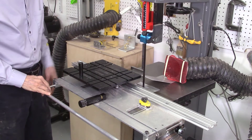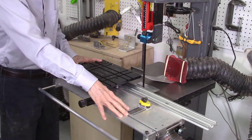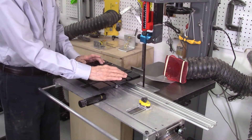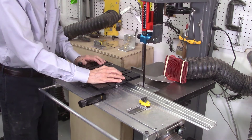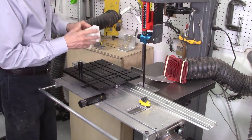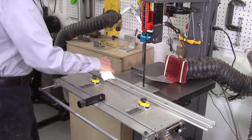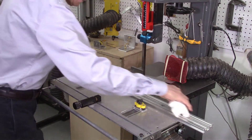Now we're ready to get started, but before we begin, we have to get the AccuSlice system and sled set up. I've installed my AccuSlice index table with a three-foot rail. The first thing I need to do is clean my channel and the roller bearings on my sled — this should be done after every project. I clean the rail and roller bearings by taking a dry rag and running it through the channel on the front edge to get the sawdust out.